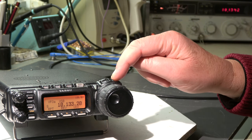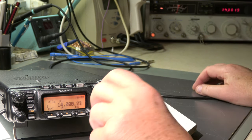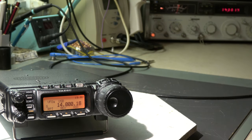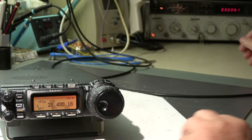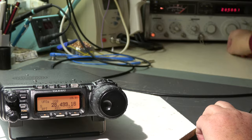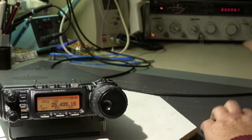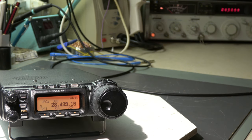I check the next one at 14 MHz - also good. We have here the 10 meter band at one microvolt; I go down to 0.3 and 0.1 microvolt. Yes, we have good sensitivity on all bands. Only transmission is bad on some bands; others are okay.